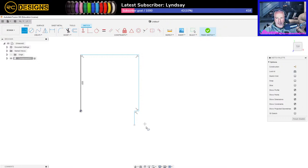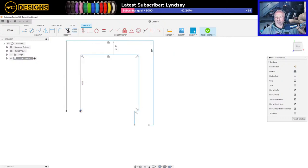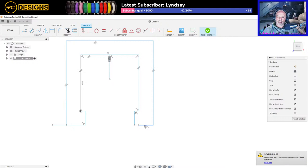Let's build this profile on this side, and then we'll mirror it over. So let's offset this 100 thou. I think 100 thou looks okay, it gives us a little bit of meat so it doesn't snap. Not like that. Let's mirror this little section over here, and then come through. Extend that, and we'll trim this one off.